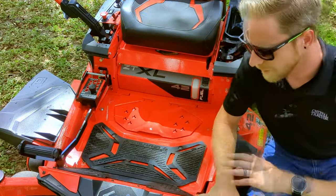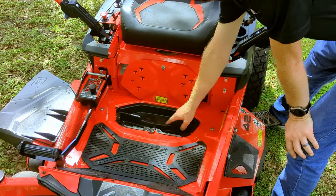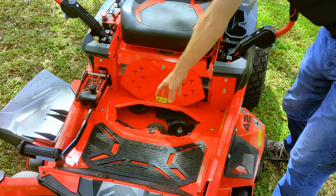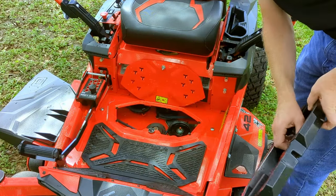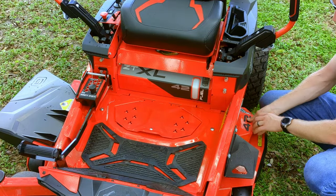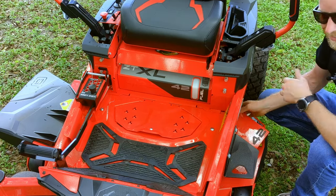Gravely was also thinking of convenience when they designed these mowers. This little area here actually opens up like a glove box on your deck — it pops open to give you a storage compartment with three trays where you can store hand tools or whatever you need. It's fully removable and comes right out, and underneath you get full access to your pulleys and belt. So if you need to clean some debris out, reseat the belt, or clean the deck off, it's much easier without having to drop the whole deck. The pan just drops right back in place and snaps in. Likewise, the side covers snap off — held in place by little grommets — and can swing out or be fully removed to access the belt and pulleys on both sides of the deck.